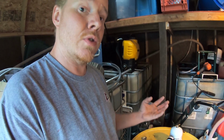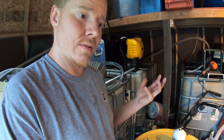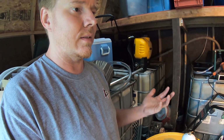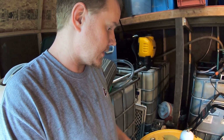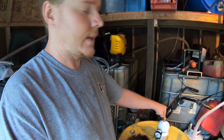It might feel like it when you spin the filters off. That's because you've still got a lot of oil and just moisture in those filters, not water, but just wet oil, not necessarily sludge that's being trapped by the pleats in the filter or the filter media. So what does that mean to us? This unit's doing a good job. That's what it means to me.